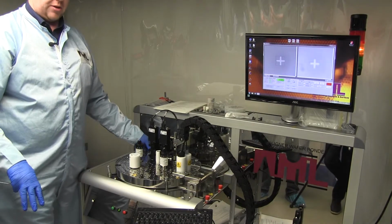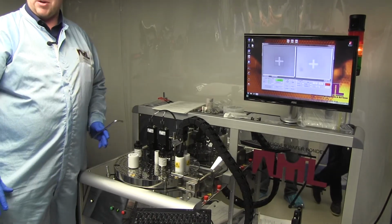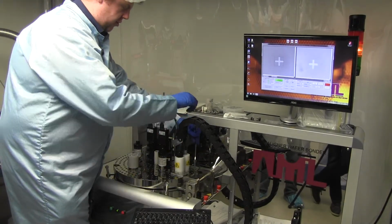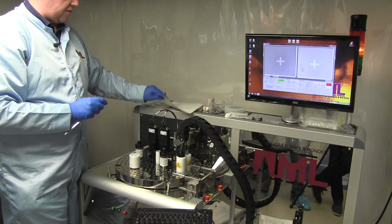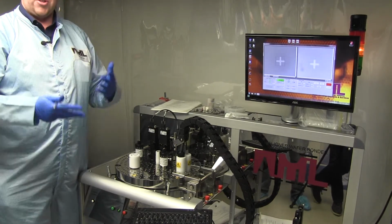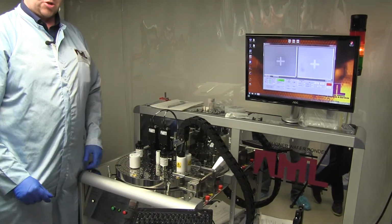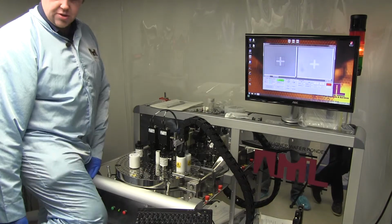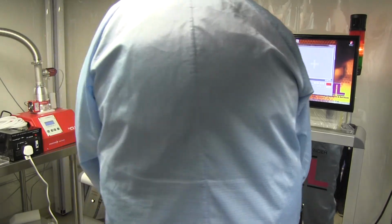But yeah, if we use a vacuum cleaner and mop everything down and dust off all the surfaces, try to get rid of as many particles as possible, and then try to keep it as clean as possible. Ideally, we only have this kind of clean room paper inside here, so no manuals and other paper or cardboard, as all of these things generate particles that cause problems for direct bonding. Also, if you can get full suits with a hat and big overshoes, like boots, rather than just these gowns, that would be helpful also. But for now this is okay.